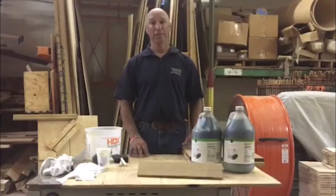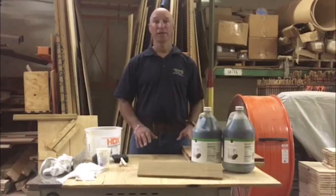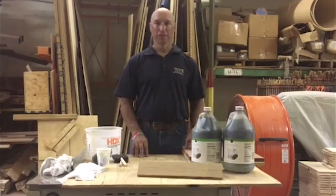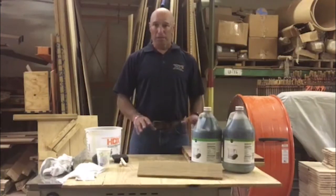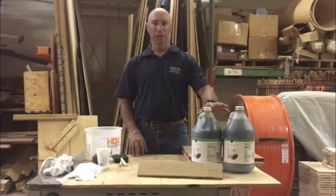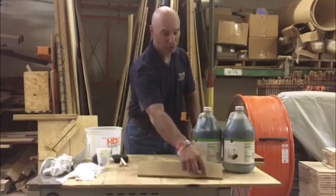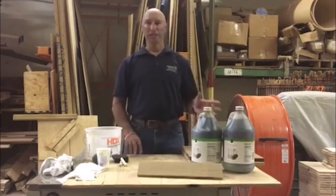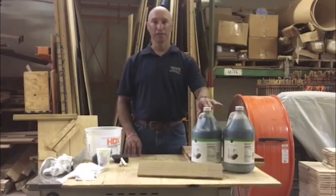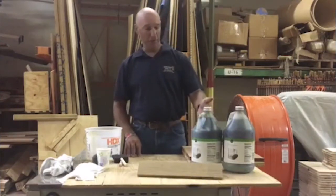Hello everyone, I'm back at my shop. It's actually Saturday morning, 11:30 — I never made it back yesterday. I spent a lot of time on the road with my crews on job sites preparing everything for when I'm out of town next week teaching in Guadalajara, Mexico. So we have part two here which is the iron acetate solution. We had our vinegar and steel wool in it for only 12 hours and I tested it — it was a bit weak. You can see on this side of the board there's a small 2x2 square and it just needed more time. So I put it out in the sun yesterday and it stayed outside all day, and now you can actually see it's in full reaction mode.